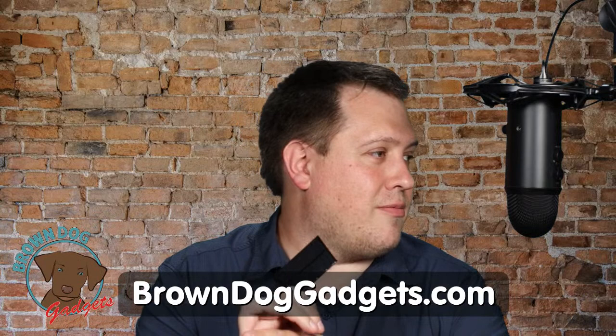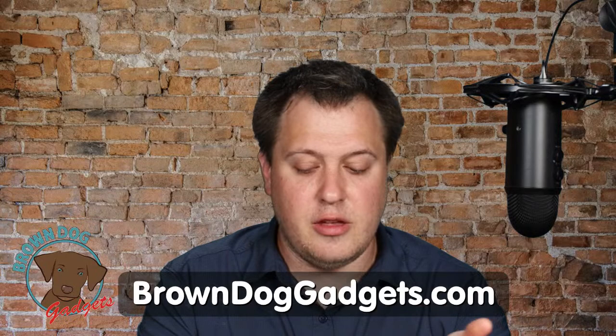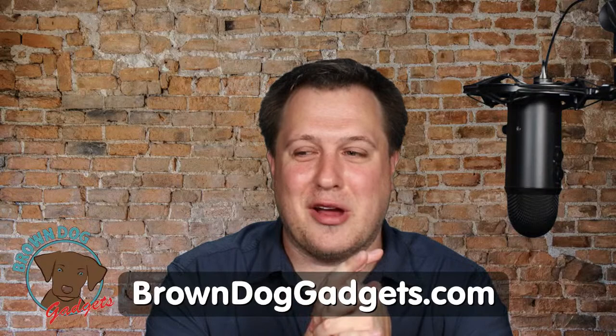So, USB typically minimum is 5-volt at 500 milliamp. So you probably want three of those 6-volt, 200 panels, or buy a bigger panel. Problem is, after a certain point, they get weirdly expensive.